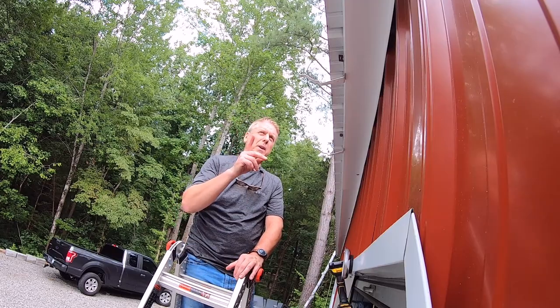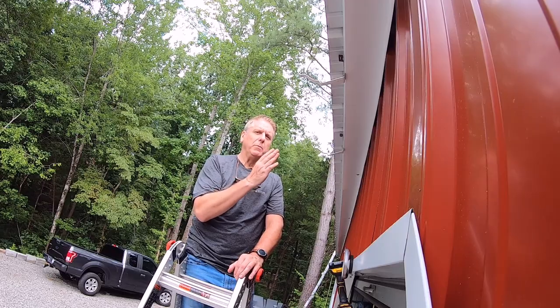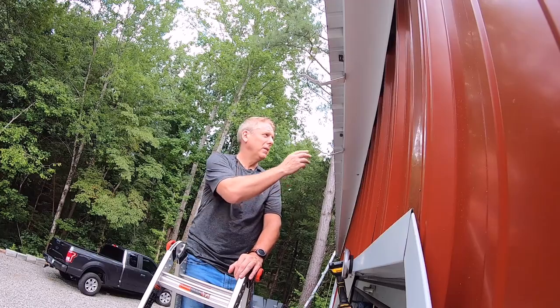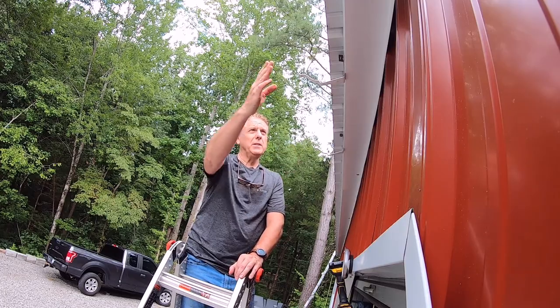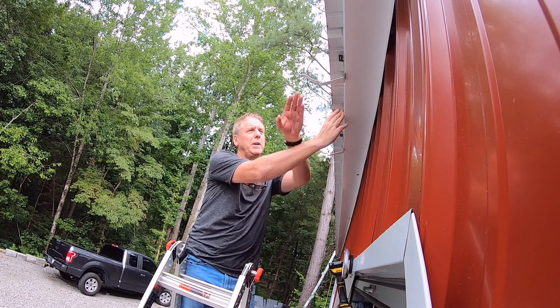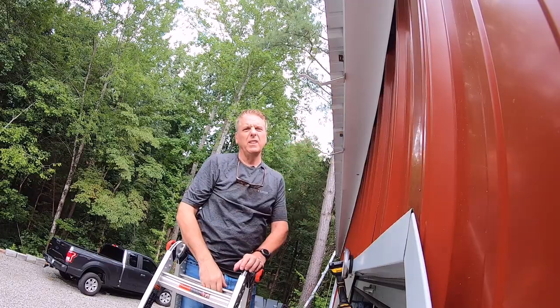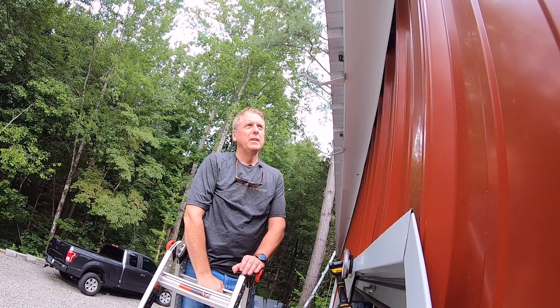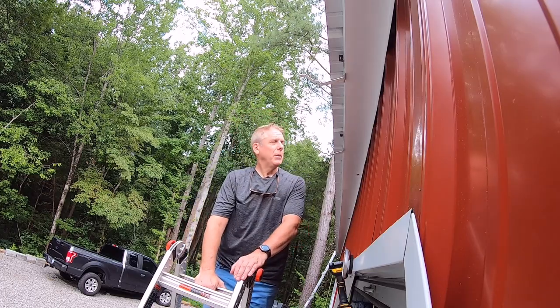So anyway, as I said before, 10 foot sections. And I felt like if I came in 1 foot from each end and then had, you know, there's four of these to a package. So that gives me every 2 feet. And every 2 feet means that that 10 footer should end right here in the middle. And between these two brackets, so it carries all the way down through, and the bracket should look even. Not that you really notice them from the ground, but hopefully every 2 feet all the way down will do the job. So we'll see. We'll keep trying. Keep going here.